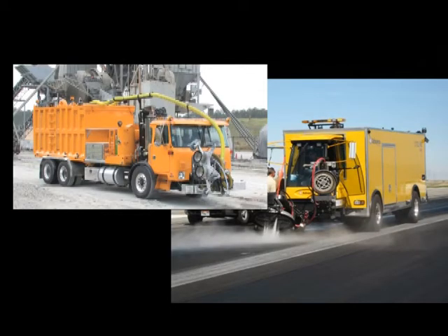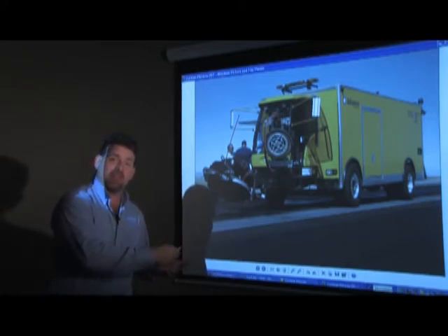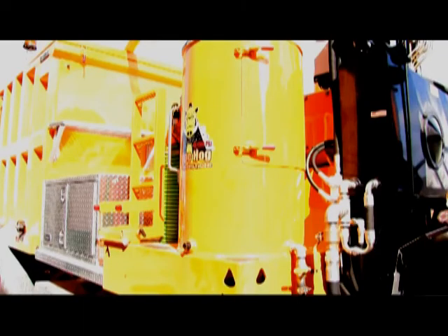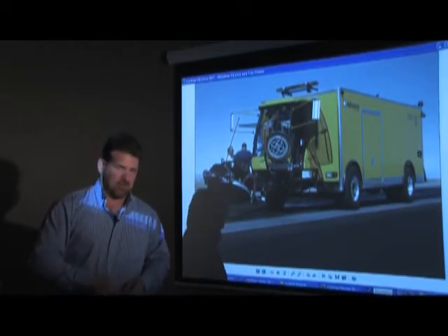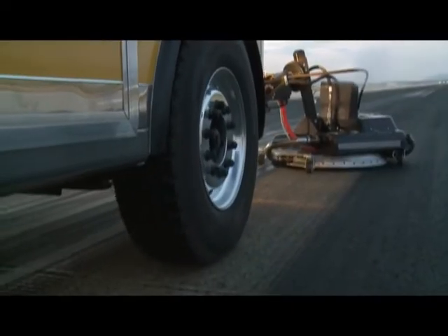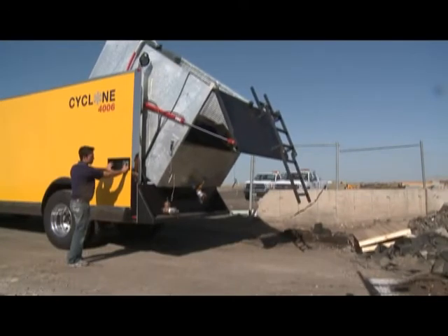Let's address what may be the biggest difference between a Cyclone machine and a StripeHog machine. Cyclone advertises that there is no vacuum required to move the material — the dirty water and the debris — into the debris storage tank. Let's take a look at what that means over time. A StripeHog has a vacuum blower, a vacuum tank, and vacuum hoses. According to Cyclone, none of these are necessary with the Cyclone machine, which in part may be true, but there are certain sacrifices made along the way that you may want to consider. While it's true that a Cyclone machine has no vacuum system, it still has to have mechanisms to remove the water and the debris generated and place it into a debris storage area.